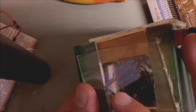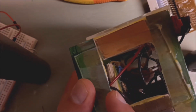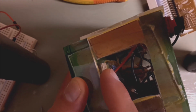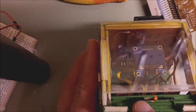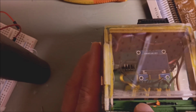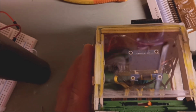There's a PCB with all kinds of resistors that make all the inputs low. So there are pull-down to ground resistors, the 10K resistors on the bottom. And then there are 220 ohm resistors as current limiting resistors, just in case I put high signals into the 8 bits into the female headers.